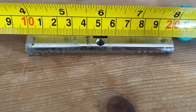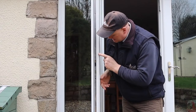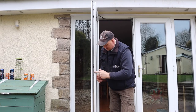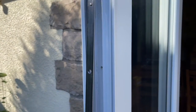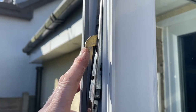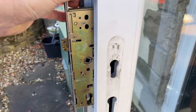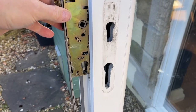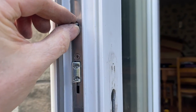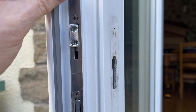The door lock is 100mm long, so if you're replacing the lock make sure you get the correct one. I've taken a majority of the screws out of the bar - not all of them - because I don't want the hook lock to fall apart. I've just been able to move the bar away from the door so the gearbox can come out. One thing I noticed while taking the gearbox out: one screw is longer than the others, so make sure you put it back in the right place.